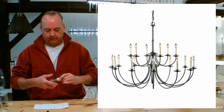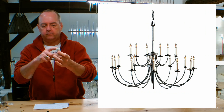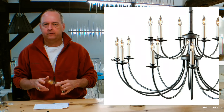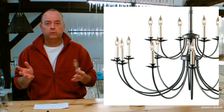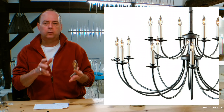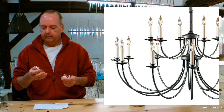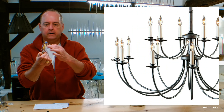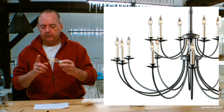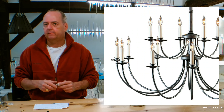It's going to be using 18 Type B sockets, and it's going to be able to accept up to 18 60-watt incandescent bulbs. A lot of you are not using incandescent bulbs anymore, which I totally agree with. Hubbardton's site lists a design preference of 25 watts, but that's still incandescent. I think you should just jump into 40-watt equivalent LEDs — you can get them clear or frosted. They do make dimmable versions, so make sure you're buying a dimmable LED and put it on a good dimmer setup for LEDs.